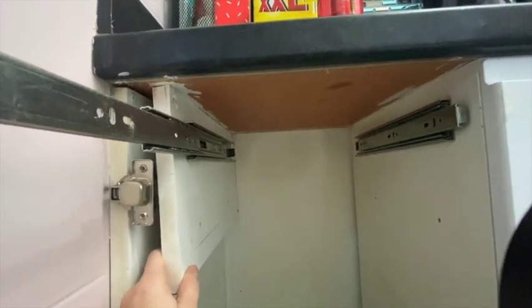I am working in the kitchen trying to fit the new drawers. This is what used to be an empty space that I made into a cupboard — I attached some hinges to the side, which I've just taken the door off. I wanted to put drawers in here, but the drawers are not as wide as the cupboard itself, so basically I put in a false board to mount the drawer runners to. It's all worked very well except for the fact that the boxes were falling apart.